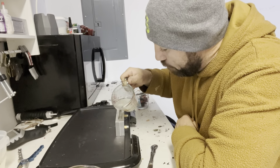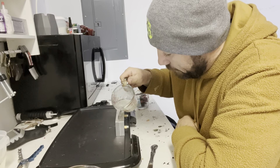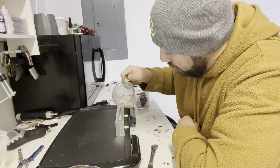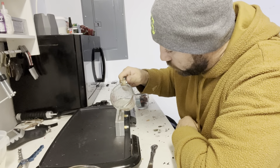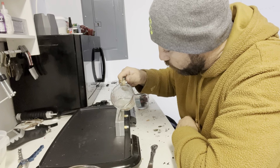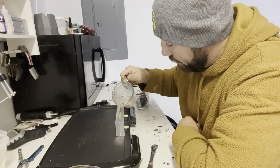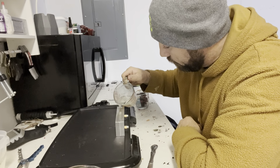I'm going to start pouring from the front so it runs to the back, and I'm going to keep it on the front portion. What I'm trying to do is keep it from running into the tail — if I keep the pour coming from the front, it'll actually cool some by the time it gets to the tail portion and won't run over into the boot tail part.